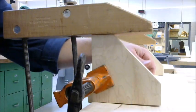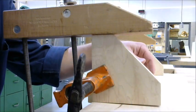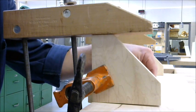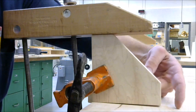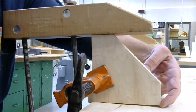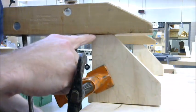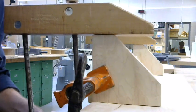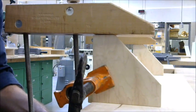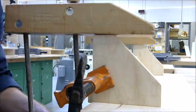One very nice feature of the screw clamp is that I can be very intentional about where I apply pressure. In this case, I need to apply pressure more right here going down so I can close this gap. So what I do is leave a gap right here and only apply pressure — I'm opening up the back screw so it applies pressure right here and closes up that gap.